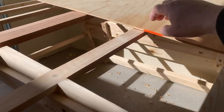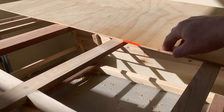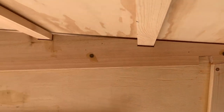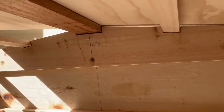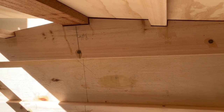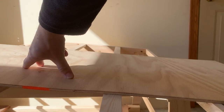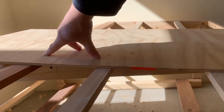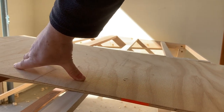The objective of all that sanding was to make sure I have a nice uniform contact on the boards here. That's got to be pushed down a little bit because there's extra weight hanging out there pushing the board up, but that all looks good. Look up under here — don't see any daylight. A little bit back here, but that's because of the weight of the board, so when I push that down, no daylight. That's all sitting nicely, so I'll slide it up just a little bit and do the same thing.